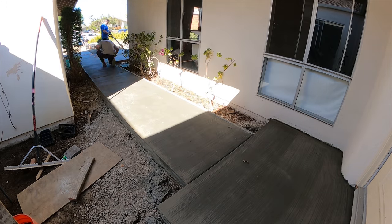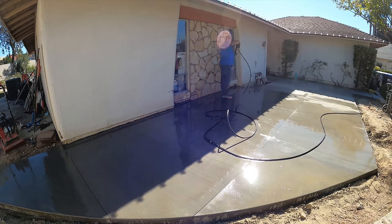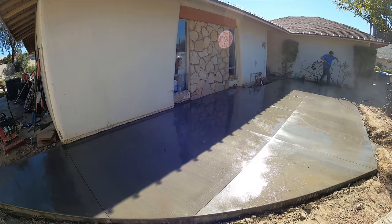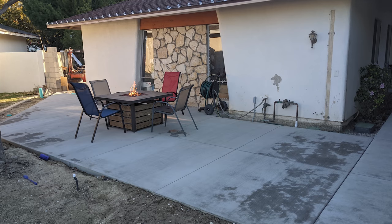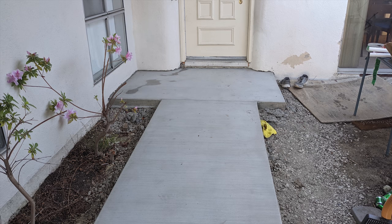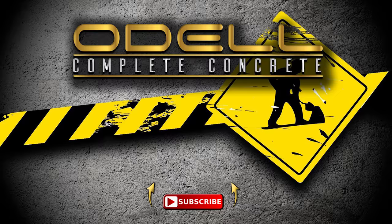I oiled up all those forms right before we started pouring — sprayed them down with liquid release, which is normally used for stamping, but I had a five-gallon barrel of it so I used it for the wood and it worked out nicely. Here's the final result — this is about 28 days after. You can see there are a few dark spots so it's still curing in the more shaded areas, but eventually it should all be that lighter color once it's completely cured. That about wraps up this job — thanks for watching. If you like these kinds of videos, make sure you like, share, subscribe, and hit the notification button so you'll be notified on our next upload. Thank you and have a good day!